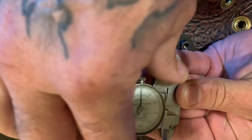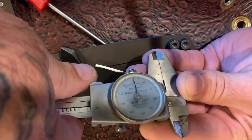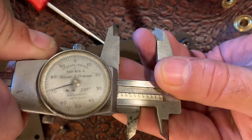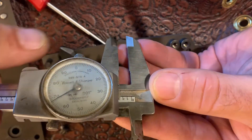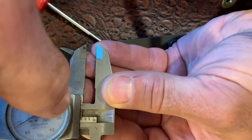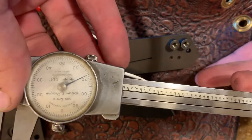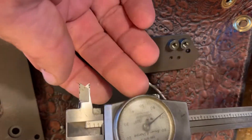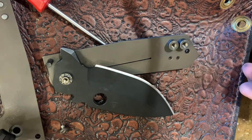How do you read calipers? Let's just assume it was on zero. You see these numbers up here — one is one inch. The one is 100, 200, 300, 400. So if I stop randomly on this, you can see the one and the two with this edge, and look at the scale — we're not past the three, so we're in the 200 range. Then add your dial to it. The dial is reading 68, so that's 268 thousandths. That's what that's saying. Whether you're measuring OD, ID, or depth into a pocket like a bearing pocket, that would be 268 thousandths.